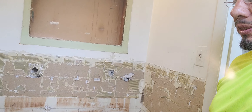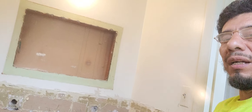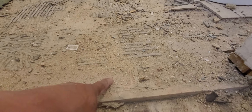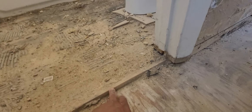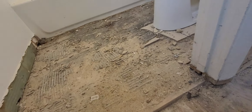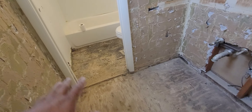I'm going to put that new green drywall on it so that it's more mold resistant, water resistant, and stuff like that. All of this is going to be upgraded to new material and a new way of doing things. I'll find out how old this building is and give you guys some dates and times if you're interested. Now that I got this sink area cleared up, I want to do the toilet room. The toilet room had a piece of plywood which I want to take off, because I want the vanity room and the toilet room to be at the same level. What it looks like is this was done afterwards as a repair — they put this plywood to be level with the inch of concrete that used to be here. But now since the concrete was removed, I need to remove that so that it's a consistent level. Then I'll do both rooms together and it'll all be one level tile.